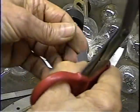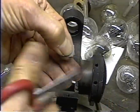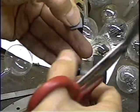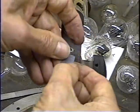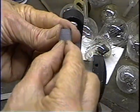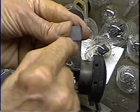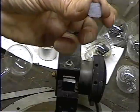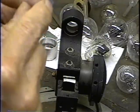Some of the tubes had the corners lopped off, some didn't — it was just whoever made them. Some had the corners cut neatly, some left them square. The old Audions did not have the leads welded on; they used a crimp. So to make this one look right, we're going to drill two small holes for our crimp wires, making it look more like a real Audion rather than using the welder. I've just drilled two holes that are 20 mils in diameter — those will be for our support wires.